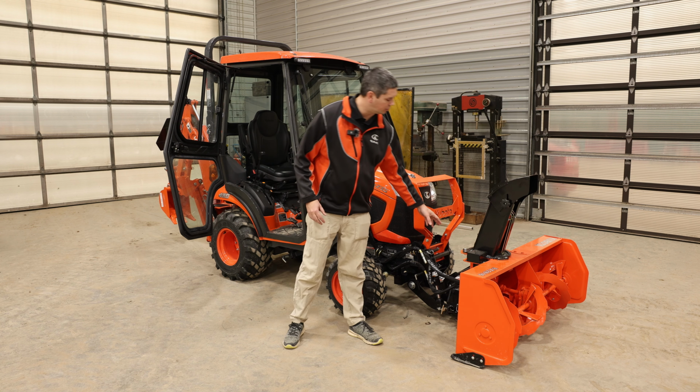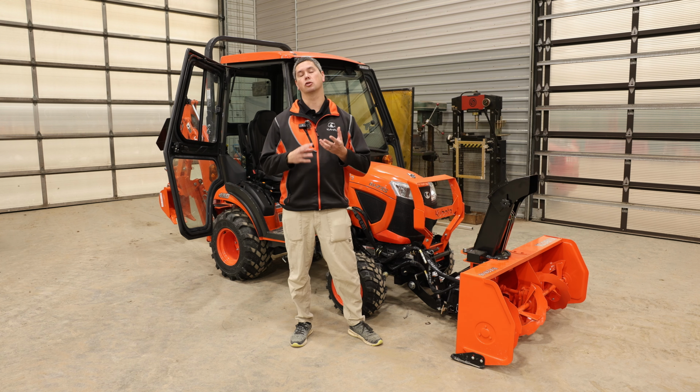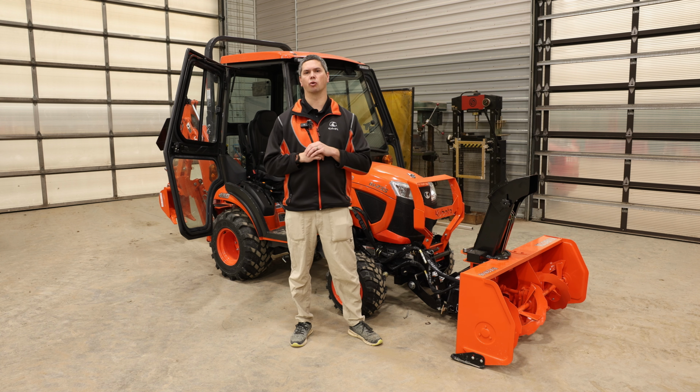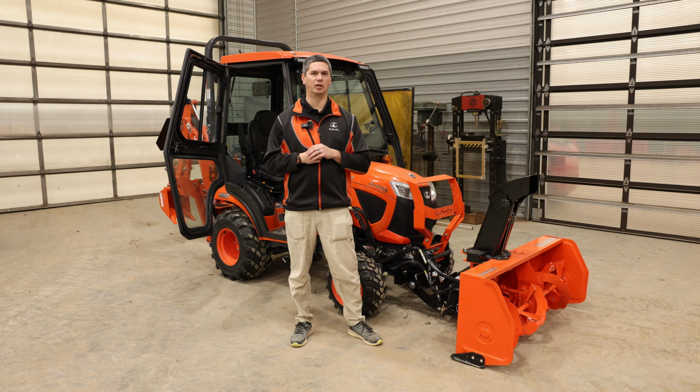And then whenever you move your PTO forward, you're gonna hear a little bit of a slap sometimes whenever it hasn't completely meshed. So a little bit extra of a louder bang for a good description on that, but it is something completely normal until it meshes up. If you keep hearing a bang, something is obviously wrong, but one at the beginning is perfectly normal.